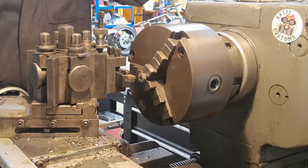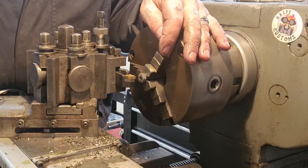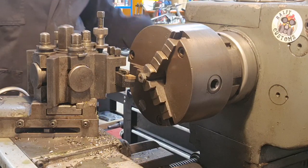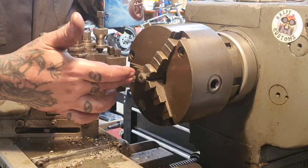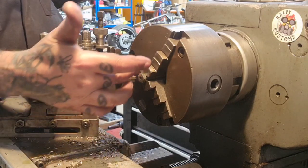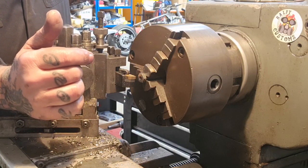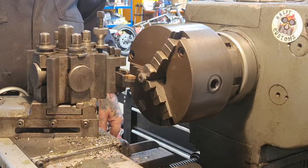So I'm going to take 4 millimetres off this, leaving 2 millimetres. I might do 3 millimetres. How deep does that mean you're going? 2 millimetres deep for the pocket I've got to make. Suppose I could half and half it. I could go 3 and 3 and make this pocket 1 mil deep and make the other pocket 1 mil deep. That makes sense. So yeah, we'll take 3 off.